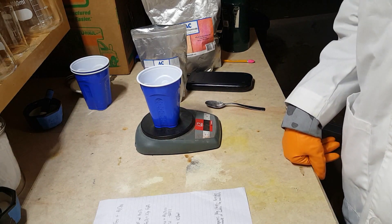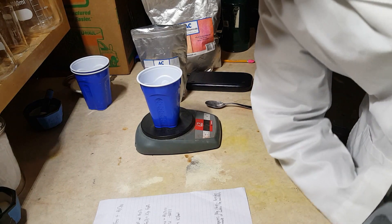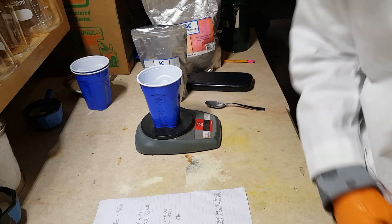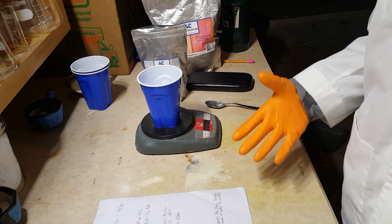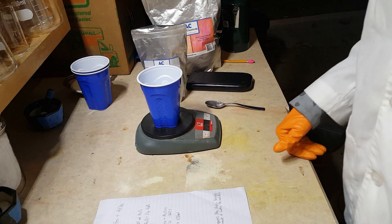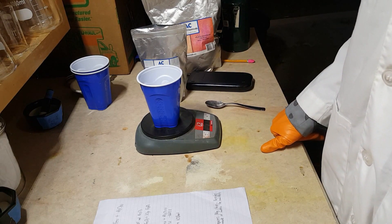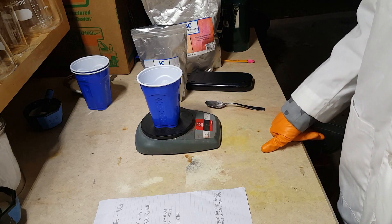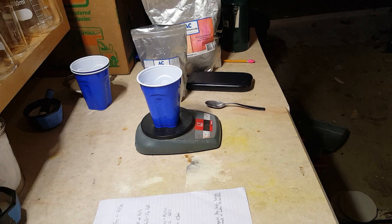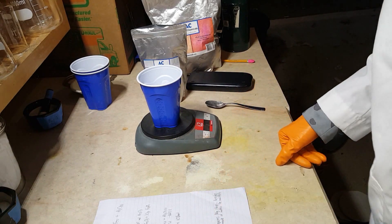The products are molten iron and molten aluminum oxide, both of which melt below the temperature at which this reaction occurs. According to my calculations, the maximum temperature this reaction could possibly reach is 3,767 degrees Celsius, but this calculation was made without factoring in the amount of energy it takes to melt aluminum oxide. It's very difficult to measure that since we're dealing with extremely high temperatures. Wikipedia says this reaction will reach around 2,500 degrees Celsius, so it could be anywhere between these two values.